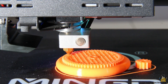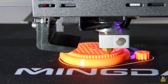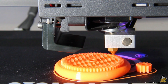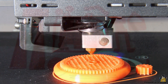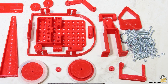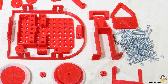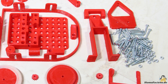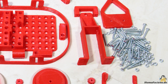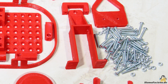For the mechanics I started two of my 3D printers. About 170g of filament per rover were processed in two days for all parts needed. The mechanics of the red rover was created with my oldest 3D printer, not perfect but with sufficient quality. Everything is held together by 3mm screws with 20mm thread length as well as a 30cm long piece of a threaded rod and many nuts.